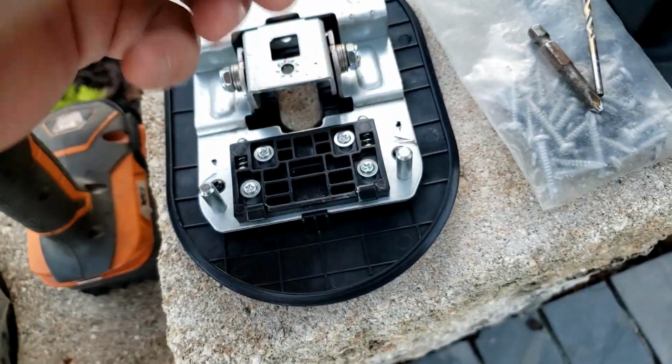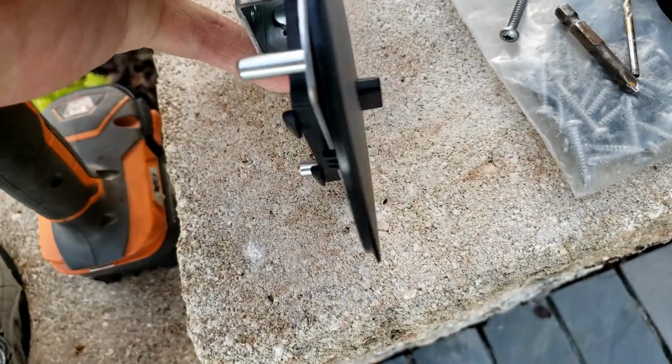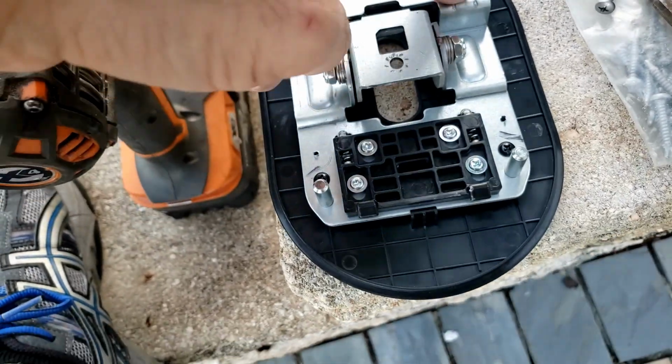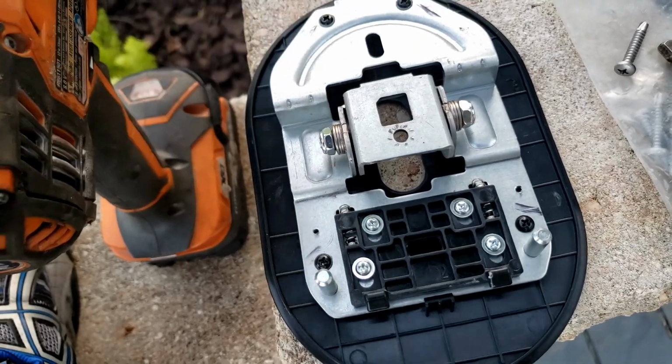I'm not gonna measure, I'm just gonna make sure everything is nice and even. And then I'll mark these two holes, drill them, throw some tappers in there. Then I'll work these other holes out. These two holes are drilled, and they came out exactly as I predicted. Right in the metal here. These might be too long, so I might find some shorter tappers, because there's only about this much length needed. These ones will probably work good for this up here, so I'm going to go ahead and mark these ones and drill them out.